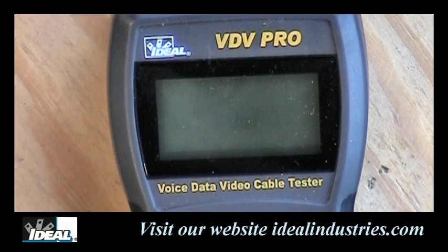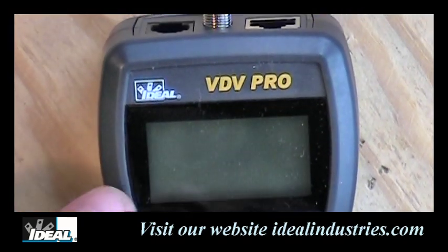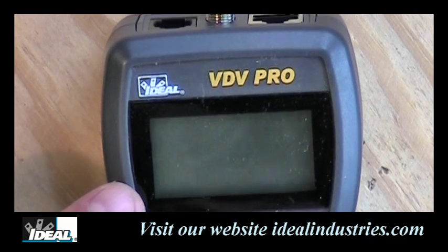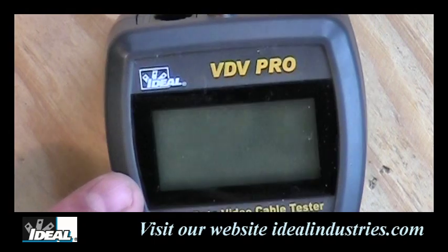Now, if you're going to use the tester for measuring the length of a cable, and you're trying to figure out if there's something wrong with it, you can plug it into an outlet someplace in a room, and if you're expected to say 50 or 60 or 100 feet, and it comes back at 20 feet, well, you know maybe there's a break in that cable.